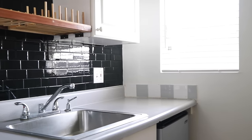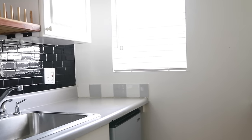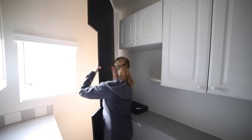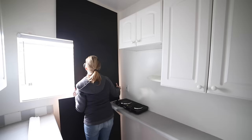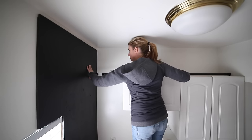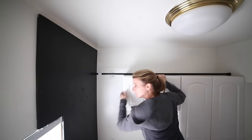The original plan for the back wall was to make it a feature by covering it all in black with removable peel-and-stick wallpaper. Unfortunately the wall was way too textured and damaged for that to look good. Then I got the crazy idea to cover the entire wall with half-inch plywood, paint that black, and take advantage of the tiny kitchen size by putting in a tension rod to wedge the plywood against the wall. Luckily my crazy idea worked, because it was a lot of work to make this into a reality.